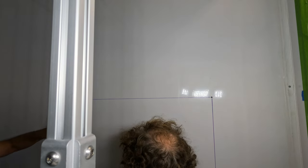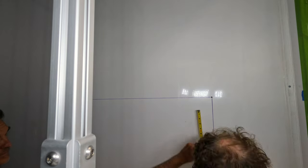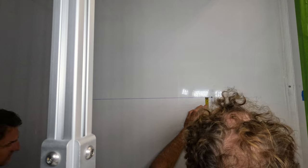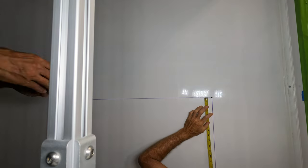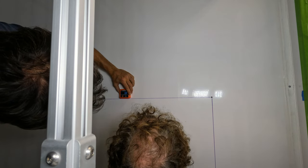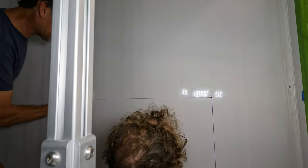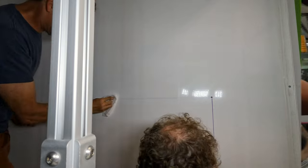And really, to cut to the chase, we measured it multiple times, many different ways, with different tape measures and different levels, digital and analog. And we found that we weren't quite right in our dimensions. The cause of that was actually because we were using slightly different measuring devices. So that's a little tip and trick. Because of that, we went ahead and erased one of these lines and redid it. That's true. We should not have used two different instruments to make it.